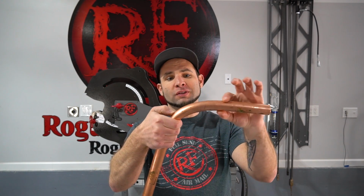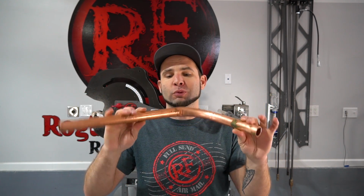So the third bend just came out of the machine. You didn't hear any snap, crackle, pop, so there aren't those little striations on the outside, but it was not solidified enough to support the tubing all the way. So likely between this one that was done pretty hot, not all the way solidified, and the one that was cracking, we would find success. Those bends were done on a 4-inch radius.